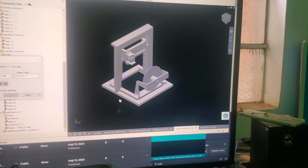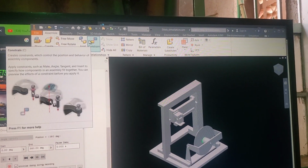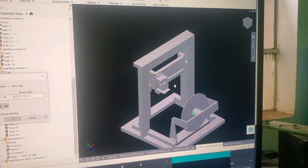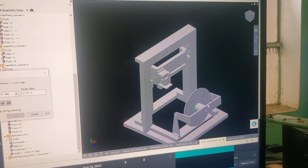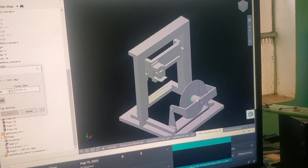Okay, I'll need to figure out where to place the screws, the motors and stuff, because I'm not fully acquainted with joints using screws, and I'm just using this joint and constraint, which in the real world doesn't really apply. Here it applies well because it just constrains planes, like a plane to a plane, that will work good. But now, where to place the screws, where to place the bearings, like this needs a bearing here and here. There's another one here, somewhere. These are a whole stepper mounted to a plate. But it looks round. I'll have to shape this later.